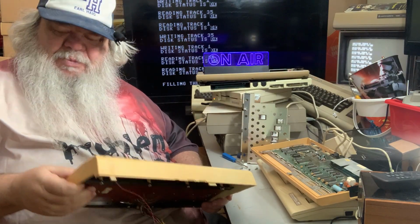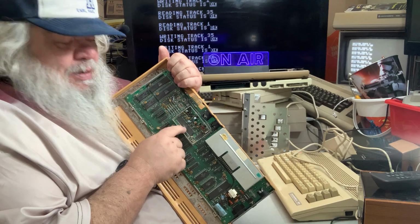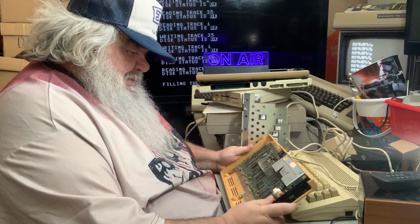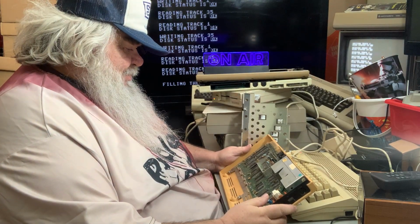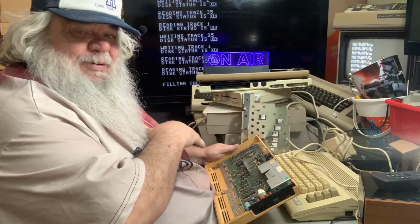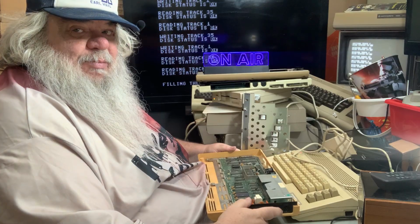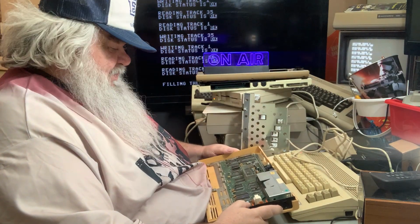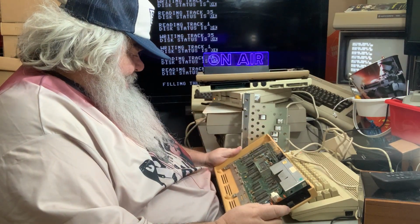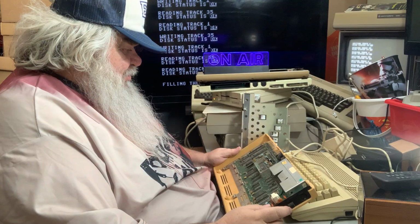Garbled video. Well, that generally points to the Vic chip right there. The 6560, the forerunner to the Vic-2 chip. Anyway, this program here is the modified performance test thing that I did, and it does a little bit more than the original, mostly. It fills the disk. So if I had a guess for this fine machine here, I would say it's the Vic chip. And that would be a pretty easy fix.